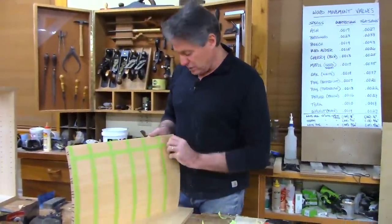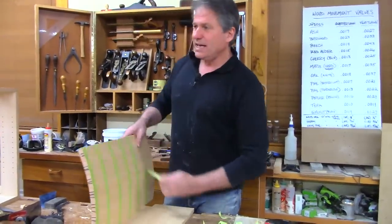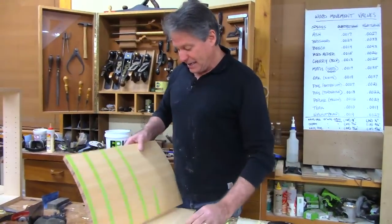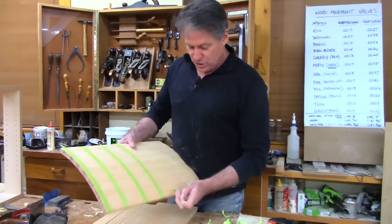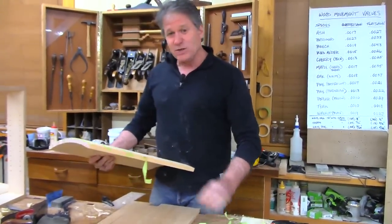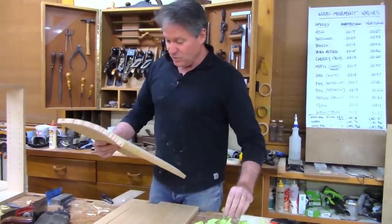Hammer veneer. What is that? That's using hot hide glue. It's an old technique where the hammer actually has a flat nose on it, almost like a hammerhead shark. You've got a handle on it, and you don't actually bang with it like a hammer. You rub and bear a lot of force along this flat edge, almost like a squeegee. But imagine the squeegee is steel instead of soft, and you're putting the glue on.